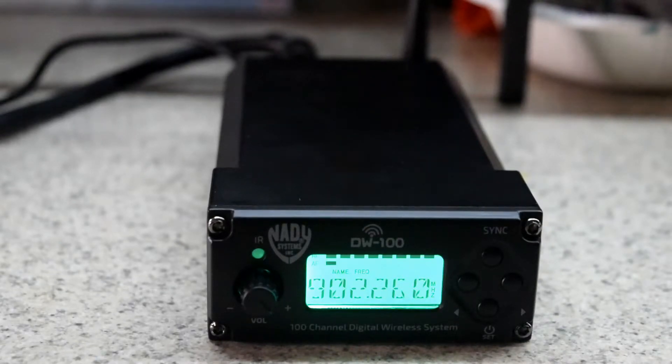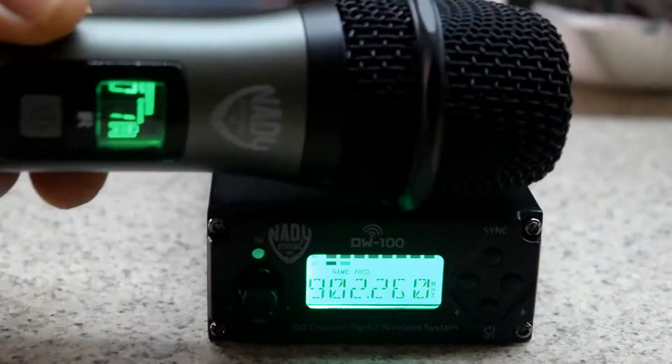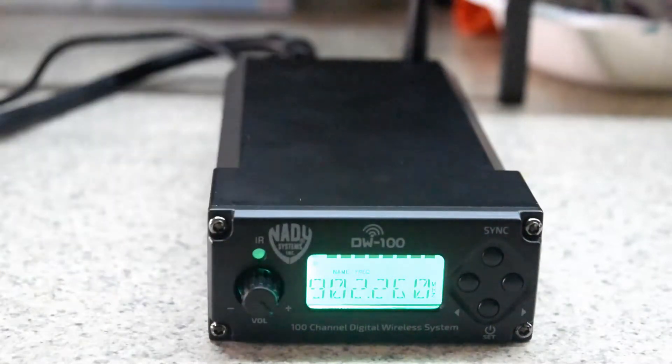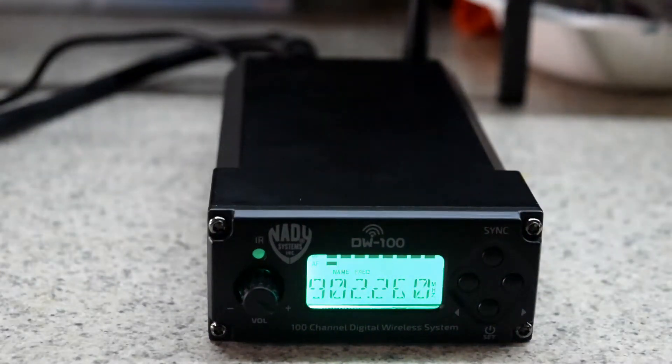The preamps on this are good enough. So right now I am using the wireless microphone that comes with it, and I'm very excited about the setup — it's super easy. The back has the quarter inch line out, and I have that quarter inch XLR connected to another XLR that goes to 3.5 millimeter, and that goes directly into the input mic jack on the DSLR.